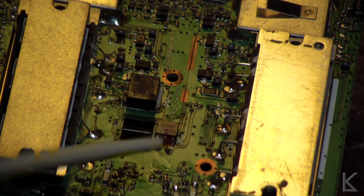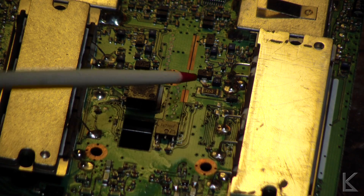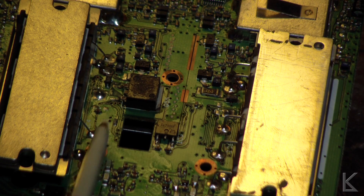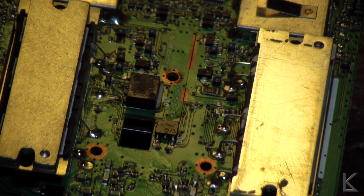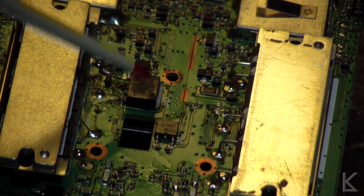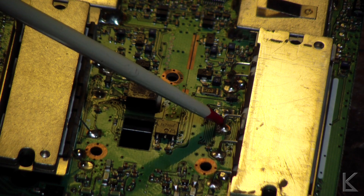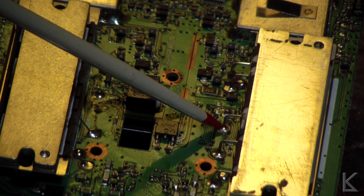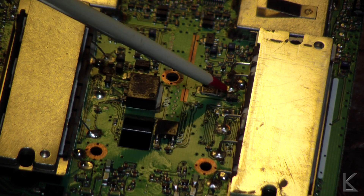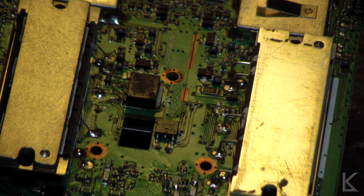These are the ones that get hot, because heat from the module comes down the wire and heats that area. So I'm going to reflow each of these solder connections on each of these power amp modules and then put it back together and see if our power is consistent. I suspect this is going to take care of it, because this connection in particular looks like it's lifted off the pad — the solder has just given away, probably from being so hot, and it's crusty around it too. You can tell where the heat comes down.